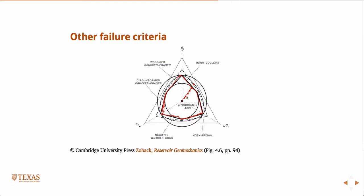And that's just because of the nature of the way I'm doing it. I take a discrete step, and I don't know what else to do except evaluate the stresses as if they're elastic. Only after I've evaluated them can I determine whether I'm inside the yield surface. If I'm inside, I'm really elastic, let's keep going. But if I'm outside, uh-oh, I can't be out here. I've violated the model. And so what you have to do is return yourself.